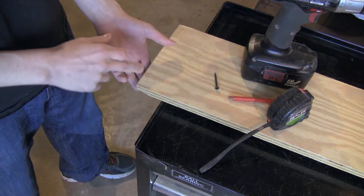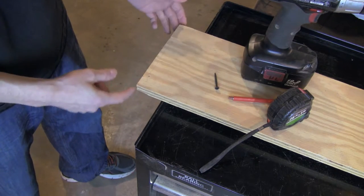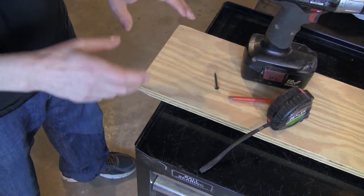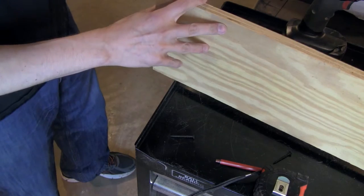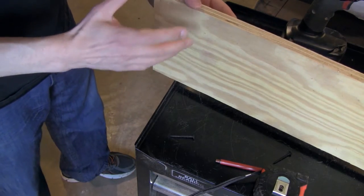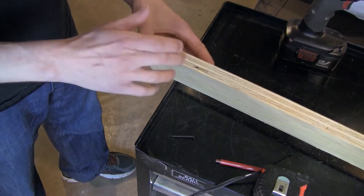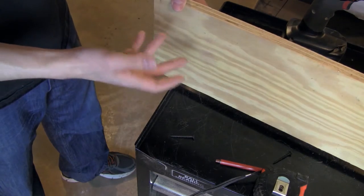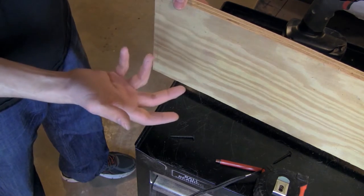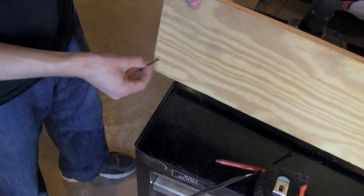You may want to go ahead and drill through the other piece as well. You can use some corner clamps, or you can just hold it together and eyeball it — turn the board up on its end, butt the other piece against the wall or something heavy, and drill through it just like that. It's best to pre-drill so you're not going to split your wood. Especially with plywood, which is more likely to split going through the plies. If you're working with solid wood, it's less likely to split, but it's always good to pre-drill your holes.